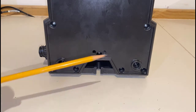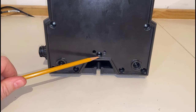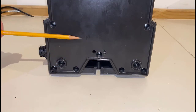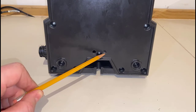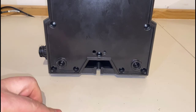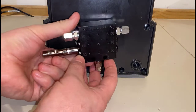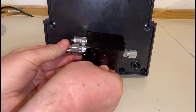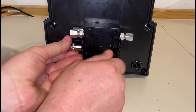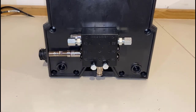One feature of the G3 pumps that few people have noticed — but has been there the whole time, the whole 10 years since the G3 was launched — there are two holes on the bottom of the unit right next to one of the mounting screws that hold the bottom cover on. Here I just have this G3 pump laying on its back and we're looking at the bottom of it. These two holes are untapped; this one you can see I already have threads in because I tapped it. You can tap these with an M6 by 1 thread, so all you really need to mount a CSP valve to the bottom of the pump is the valve itself and a couple of M6 bolts. You'll also need your M6 by 1 thread tap.